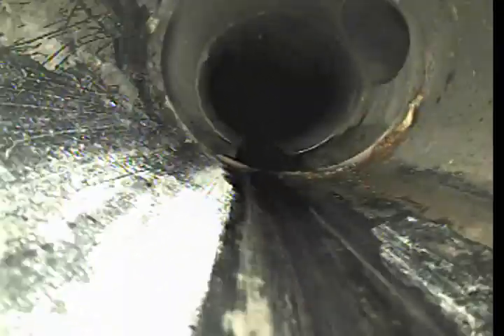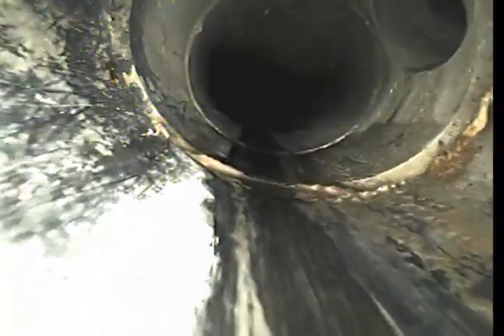We're going to head in toward the house. We're at the top of the pipe, going in toward the house — it's going to be cast iron. The bottom of the pipe is pretty much worn out; you can see the valley right there. At about 6 feet, we transition from cast iron 4-inch into ABS. There's a tie-in at 7 feet on the left side, and another tie-in on the upper right side at the 10-foot mark.